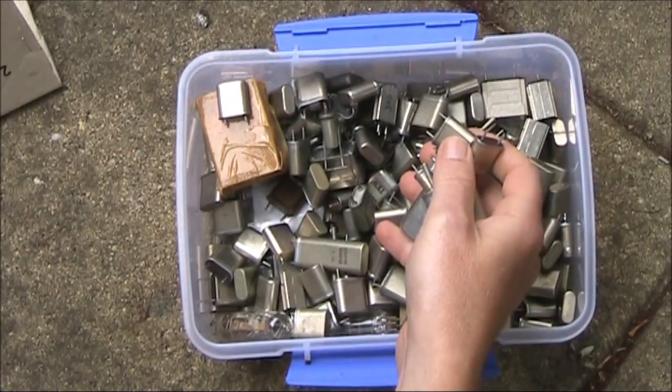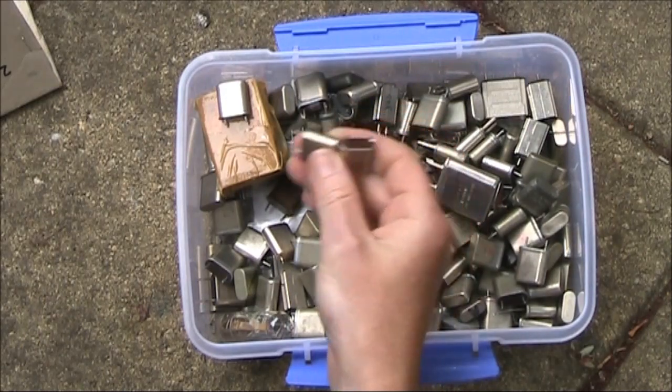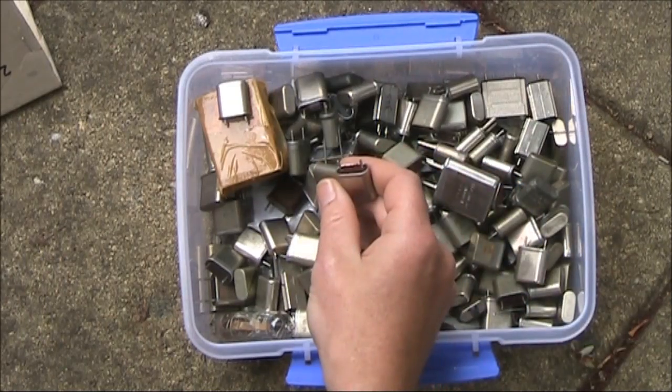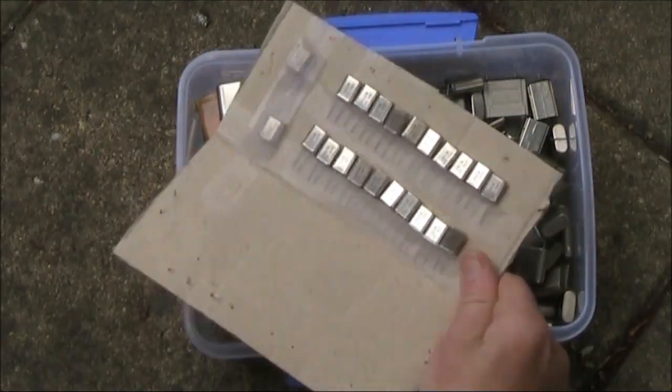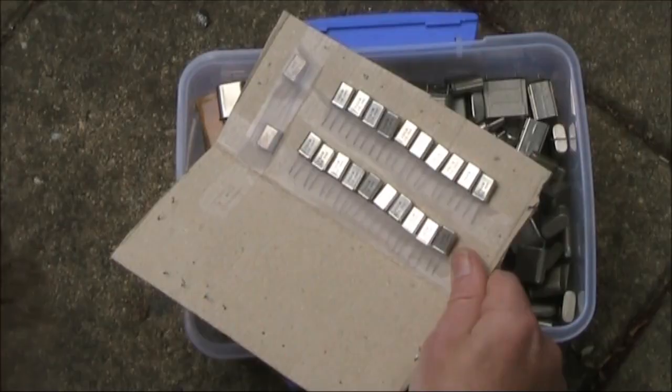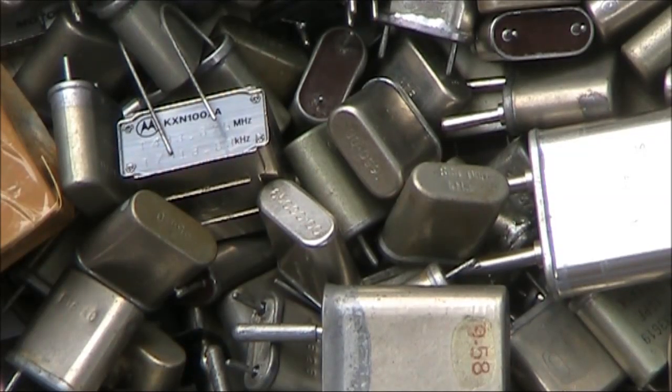As for the serendipity, that can come from finding two of these crystals that when mixed together can provide a desired sum or difference, suitable for a receiver or transmitter. It's even better if the crystals are standard off-the-shelf frequencies, so you don't have to rely on an extensive junk box to duplicate. A further bonus is if you can use commonly available frequencies to operate on 2 or more bands, especially if those bands are desired and useful for QRP. As DeMaw and Hayward said many years ago, 40 and 20 meters is a great band combination that allows DX and local stations to be worked day and night at most phases of the solar cycle.